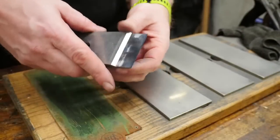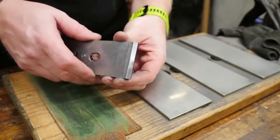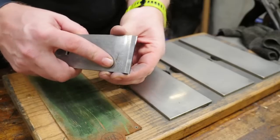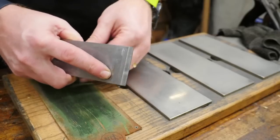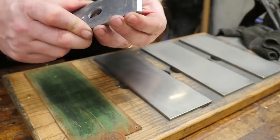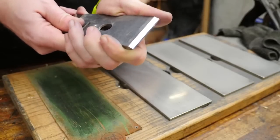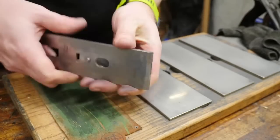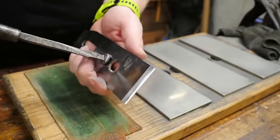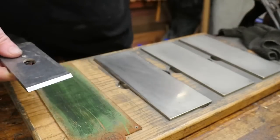Oh, I'm on the wrong camera, sorry. Rotate it over. Slide that up. I'm going to put this one about a 16th inch away because it's not a really fine cutter. It's just number 5. Tighten it down. Back it up just a hair. Oop, not that far. There we go. And then we can tighten that down. Put it back in the plane.